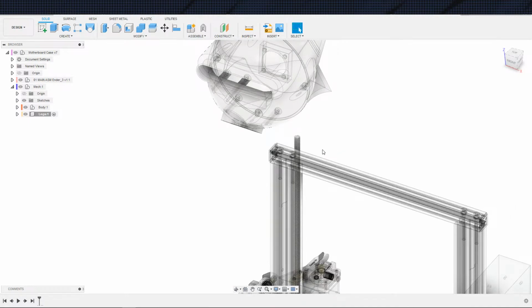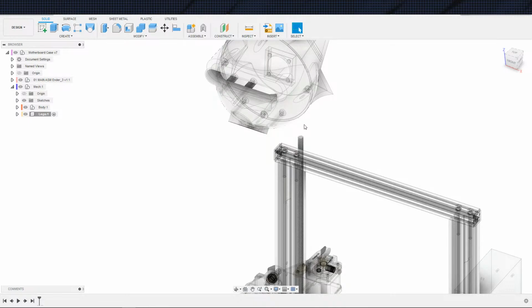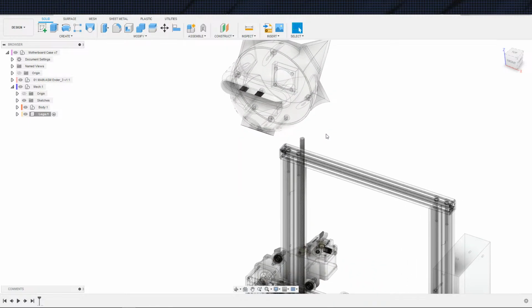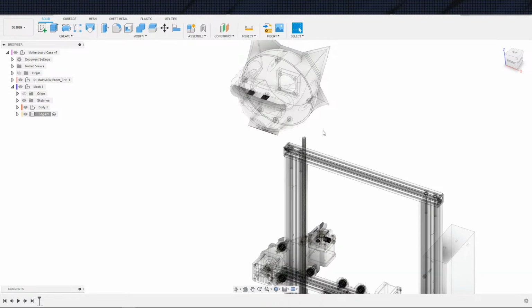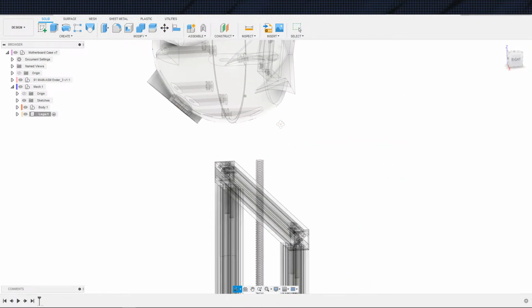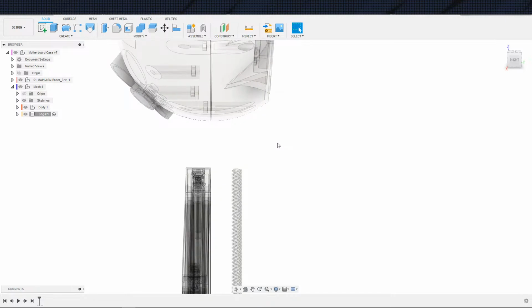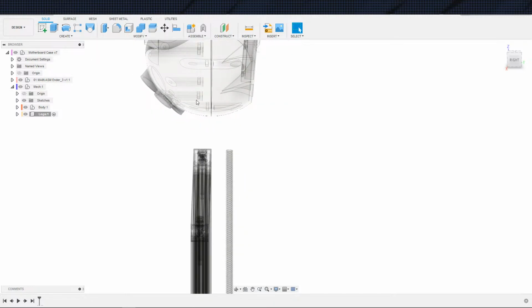The next question is where exactly to start, because the problem I'm going to end up with here is the tangents to the body. And the other thing I probably should consider is where exactly this leg's going to go. I guess it should go kind of like this. Round about here. It may overlap the back wall, but the back panel rather, but it's one of those things. It doesn't necessarily have to be connected physically to the back panel. The other thing is, I guess it actually has to be bolted on if it does overlap the back panel, because that's not going to be printable, because again, we're printing on this split line.